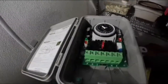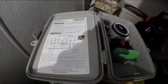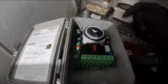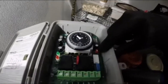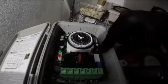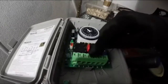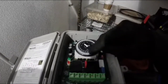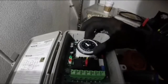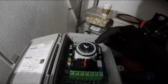This new time clock will replace a ton of clocks for electric defrost. This dip switch lets you determine if terminals two and four are normally open or normally closed. I'm going to have it set for normally closed — power up to two, neutral on N, and my switch leg will be on four. With this clock we get the ability to have different defrost cycles throughout the day; each pin is 15 minutes. With the old timer they were just running it off for two hours at night.